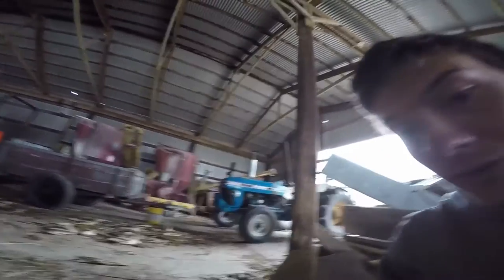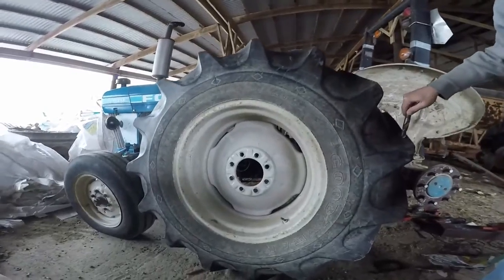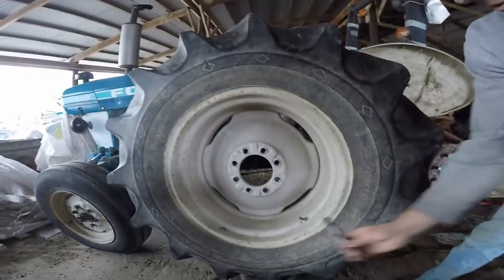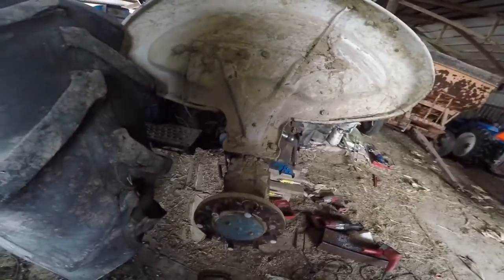So I'm back to drilling holes. I got the three-quarter inch bit back here — got to put it in the drill and then we'll get going, hopefully it cuts great. Dad found a little machine shop in town that would sharpen it for us. We use this bit quite a bit. If you hadn't noticed, these aren't standard Ford rims — we got these off a combine. And guess what this bit was used for? Drilling them out to match the gigantic studs that Ford uses. Instead of a five-eighths, they like to go for three-quarters. So we'll chuck it up and away we go.